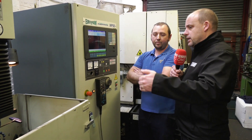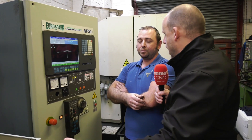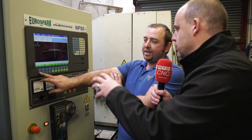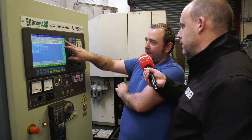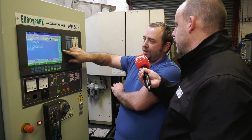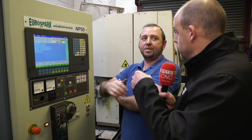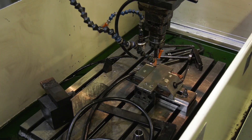And with different materials, you need to machine at different speeds. How does this machine know how to cut this type of material — is that all in your software? Yeah, it's all inside the program software. If you tab over to here on your E-keys, it creates all the parameters: your voltage, your amps, flushing distances, working time. So you tell it what material it is, and it'll tell you how to cut it? Yeah, that's it.